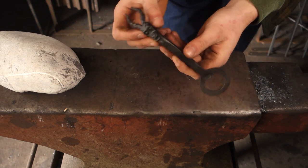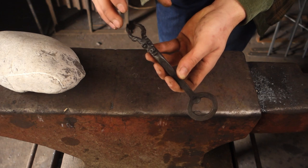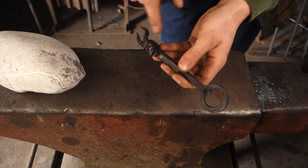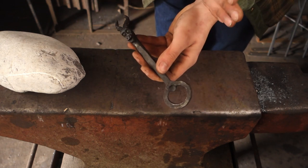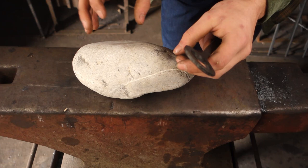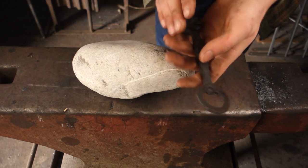This is just a bottle opener that we've got this on, but I just wanted to show you what I'm trying to make. I'll go into a little bit more detail in this video on how I make this head. The first thing to do is to put a bit of texture on the head bar, then create the step down for the horns. We'll let that cool down so we can come in with the angle grinder to cut the horns. And whilst that's cooling down, we can forge out the U-shape piece — sort of a Loch Ness, Nessie type of sea monster with a head, a U, and a tail. So let's get a piece of 12mm round heating up in the fire, and then we can start on the head and then move on to the body.